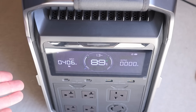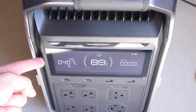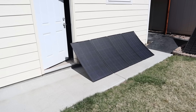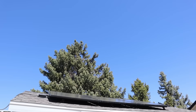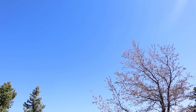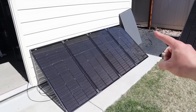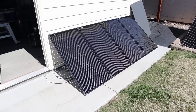With the 400-watt solar panel connected to my Delta Pro 3, we are getting 408 watts input — a little over the rated output, which is fairly impressive. For context on solar conditions: it's right at midday at the end of March with no haze or clouds, so really good testing conditions. To keep the test fair, I've moved the 400-watt panel and set the 500-watt solar array in the exact same spot.